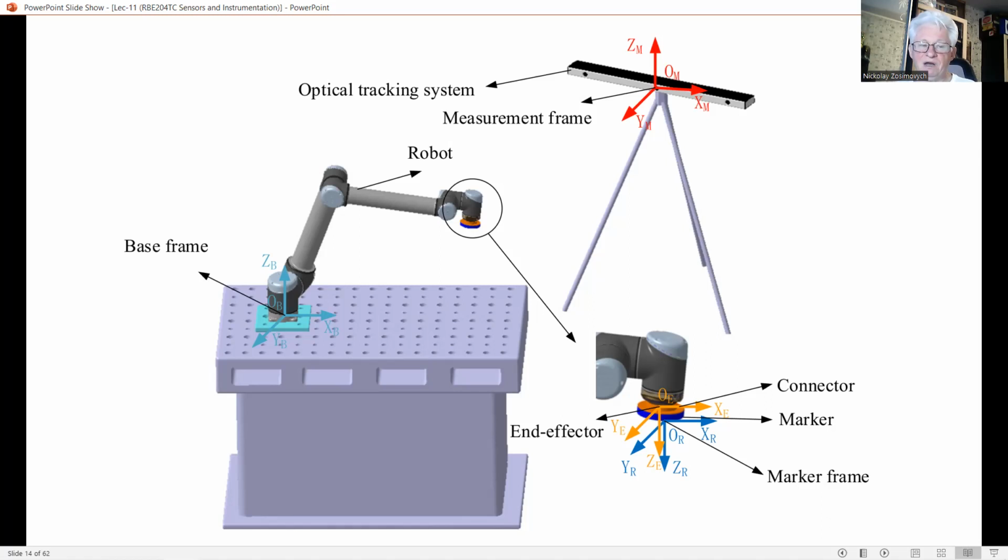Measuring the TCP with respect to the robot coordinate frame may provide data for compensation for such errors. A well-known approach uses a light source mounted on a suitable place near the TCP, emitting light in all directions. The light is perceived by a set of cameras, like 2D PSD with CCD matrix, positioned at fixed known locations, together covering the full workspace of the robot.